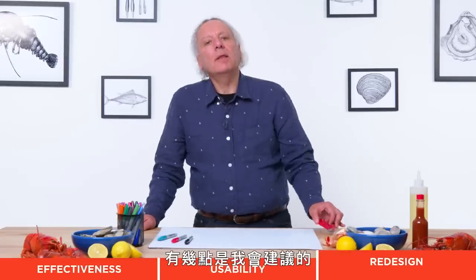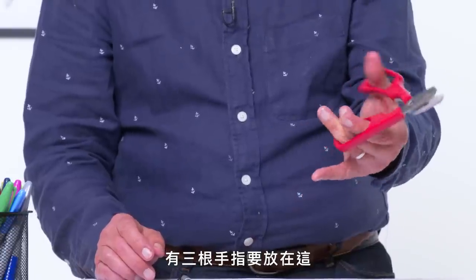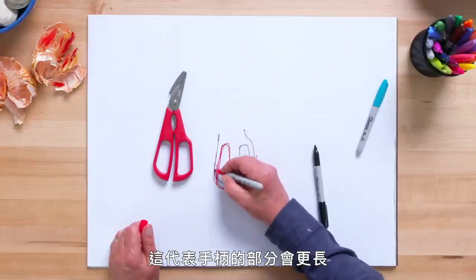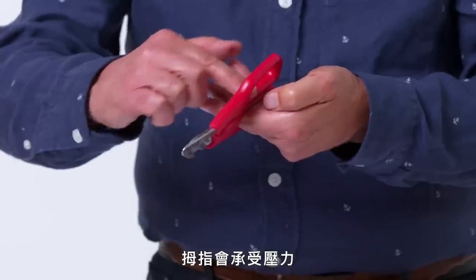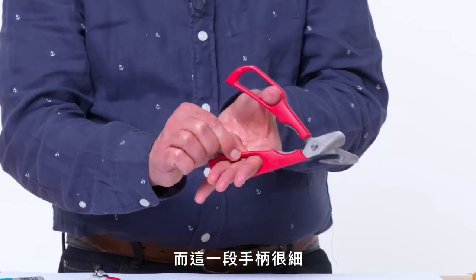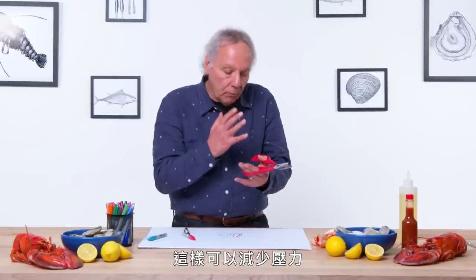For a redesign, this finger area is a bit tight — we want to get three fingers in there, and those three fingers are a bit jammed. It would be great to get a pinky in there too, because the pinky, being further from the pivot point, can give quite a bit of leverage. Always include the pinky when squeezing something. So I think we need to come out more with that opening, making the handle that much longer. Also, the inner surface where you apply pressure is a little thin — I would make it thicker and flare it out so that pressure is reduced across a greater surface area.